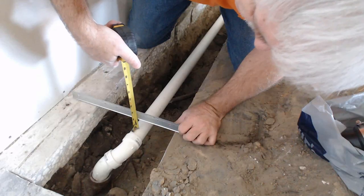Let's see how much I've got to cut off. We're at inch and three-quarter here. I need a minimum of one-eighth per foot, and I'm 12 feet, so one-eighth per foot for 12 feet — that's 12 eighths, that's inch and a half. So I'm at inch and three-quarter with an inch and a half drop. That means my line will be embedded in the concrete for the vast majority of the distance. I don't want that — I want this to be lower. If I want it to be three inches below the concrete on that end and the top flush with the concrete on this end, this has got to go down three more inches.